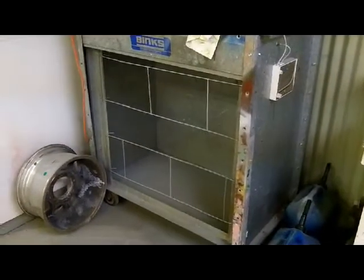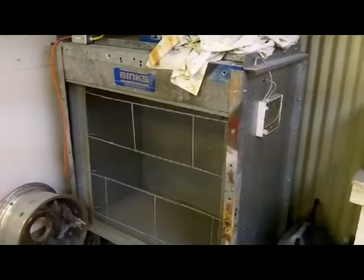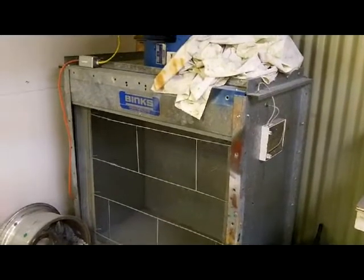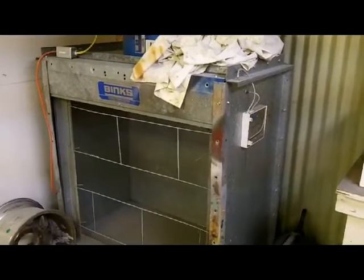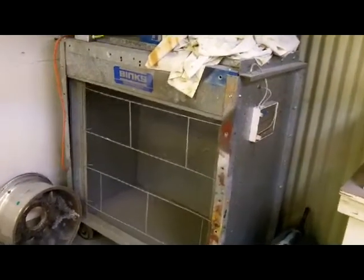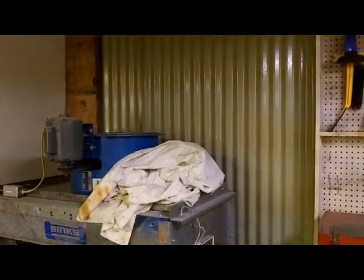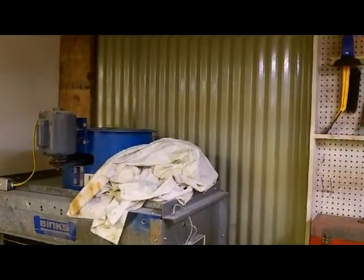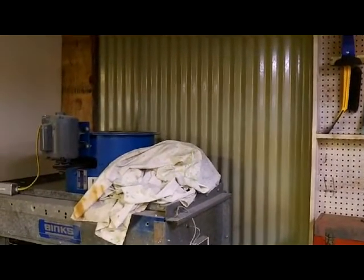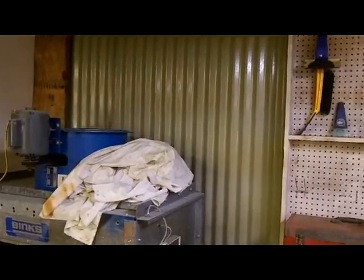My little paint booth, which I'm not using right now. I'm using my big fan with my filters down the hall. I wanted to get this going for doing spot stuff and moving it up real close to where you're working, not in your way, but this thing moves some serious air, and I need to get some duct work and then put my filters in the front of it. This was actually a small hobbyist paint booth, but it moves some massive air, and I've turned it on while I was painting before, and it draws overspray like crazy. I just need to find some 18-inch tubing or fabricate something like the stuff they use to ventilate the guys that are working down in the manholes, like city workers and utility workers. I need something about that size, and then I'll duct it out the side of my building.